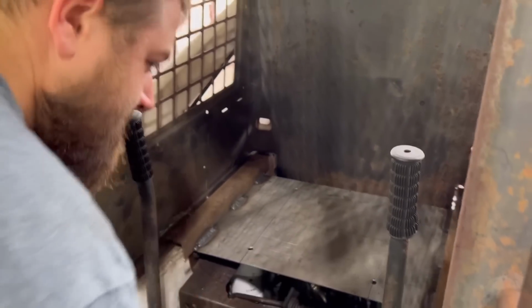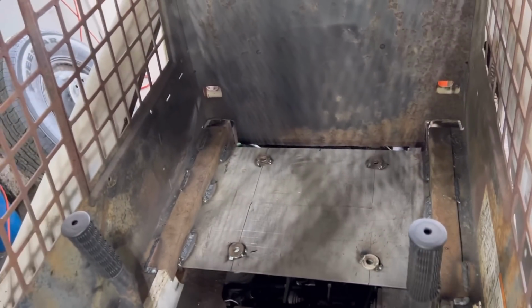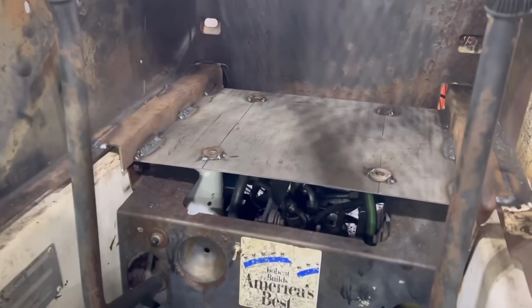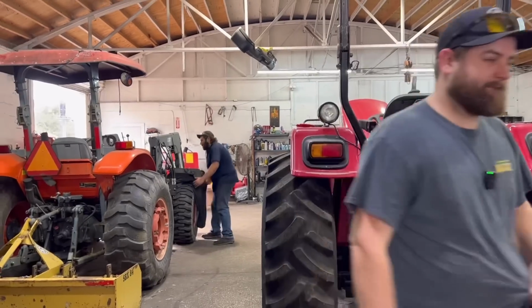Right about there. Let's put some tack-tack-tackaroos on her. So got this boy welded in there. Again, Wilson Fab. Ready to rip. I had to make some spacers to bring it up just a tick because of the way the seat's made. So we dropped it down 2 inches, but we picked it back up another quarter inch or 3/8 of an inch. So let's get this seat set in there. You ready to bring her over here? It's going to be fun putting it in there and then putting these bolts in on that hot plate.